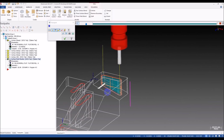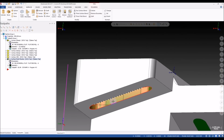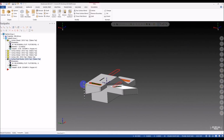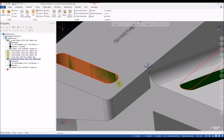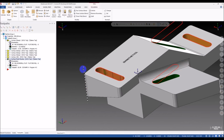So we can eliminate the wasted move of the tool where it is not in contact with the material. For safety or clearance, you can extend this surface a little bit, extend here to the bottom, or extend it from here to the top. There's one important thing you need to remember: you should break the chain at the center of the arc. Do not start from here, or here. It's very dangerous and it makes the toolpath go crazy. That's my experience. And you move the along contour far away from the across contour.